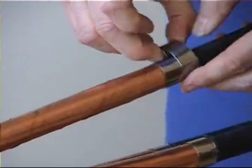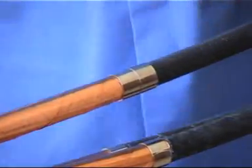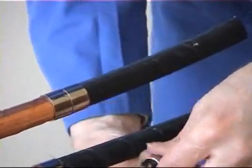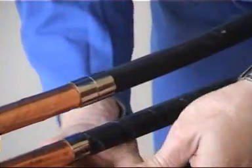Again, according to the instruction sheet, you need to make a dimension from the edge of the copper tape to the end of the conductive screen, and here we've used another roll spring once more to facilitate a straight edge at this point.